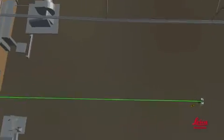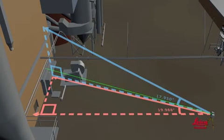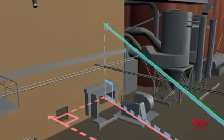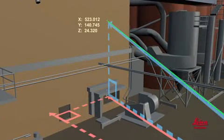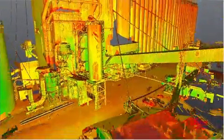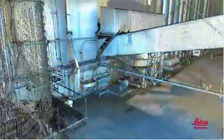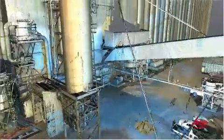But there's more to 3D scanning than just measuring distances. Yes — for each distance measurement, additional critical data is recorded, including the corresponding horizontal angle of the rotating laser and the corresponding vertical angle of the moving mirror. The scanner automatically combines these to calculate a 3D x, y, and z coordinate position for each point. The resulting scan is a set of 3D coordinate measurements — a detailed 3D representation of the scene, often called a point cloud. Matching photos can also be taken to add realistic texture or color to scans.